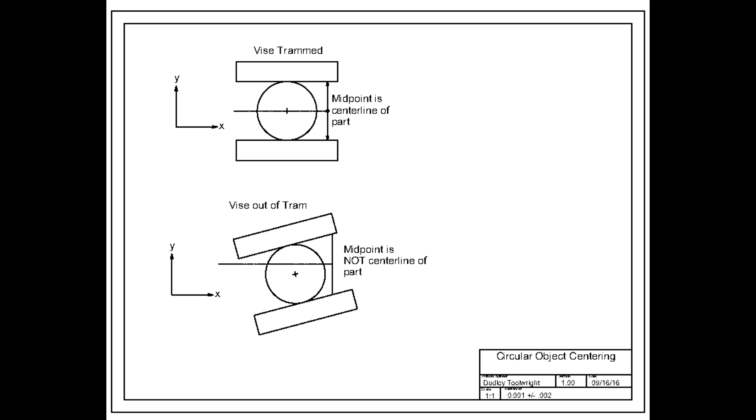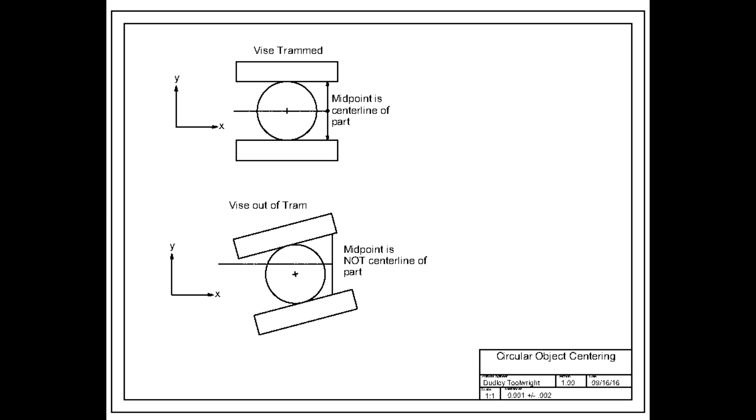Once you've got all that, you can find the centerline of the part. If you don't have a coaxial center finder and want better accuracy than just dropping a point — even if you have the center marked on the part already — dropping a point in your quill to line up is not terribly accurate. Hopefully this was helpful. The drawings are available for download if you want them for reference.